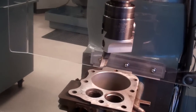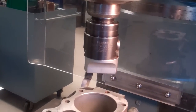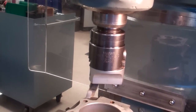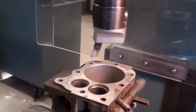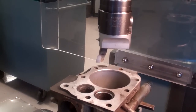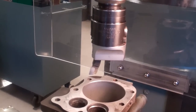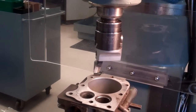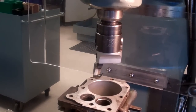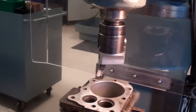I've got the boring head with a carbide boring bar chucked in the machine and I've got about four and a half inches of travel. I need about three and a half inches to get all the way through the bore, so I'm just going to make it. I'm going to take a first light pass, remove a minimum of material to make sure everything is good, then bring it up to my 20 over.